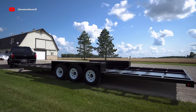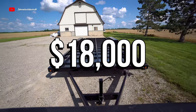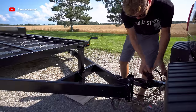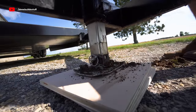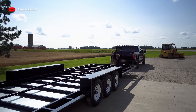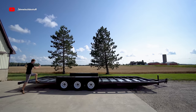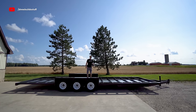So I'm starting off this build with a good custom-built trailer that's specifically made for tiny homes. This trailer is overwidth at 11 by 30 feet, and I decided to go overwidth because I'm a pretty big guy, and by the time I closed in an 8'6" room, I'd barely be able to lay down horizontally. Plus, this is going to be a fairly big unit that's not really made to travel, it'll just move when I move, which will be like every few years, so it's not that big a deal to get a wide load permit.